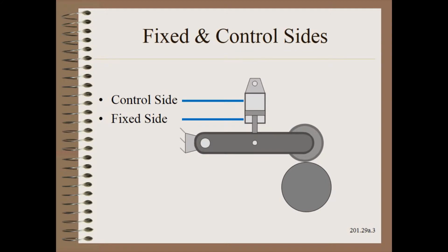The gold standard for piping many systems is to pipe on both sides, even if all required functions can be accomplished with one side only. Here, the fixed side counterbalances assembly weight. The control side does the work on the product. There are many advantages to this approach.